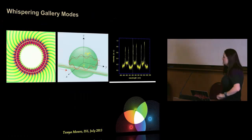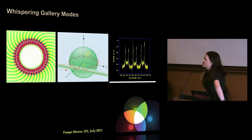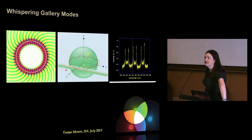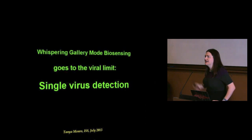This is a simulation of light rattling around in a whispering gallery mode resonator. One challenge is: how do you get the light into it? One way is to place one of these microspheres right next to an optical fibre or taper. You launch light into the fibre, which excites the resonance, and also reads it out. If the resonance shifts because the environment changes, you measure a shift in wavelength. I'm going to show you a video of how researchers have taken this idea and used it to detect single viruses binding.